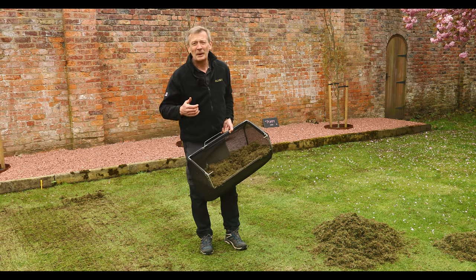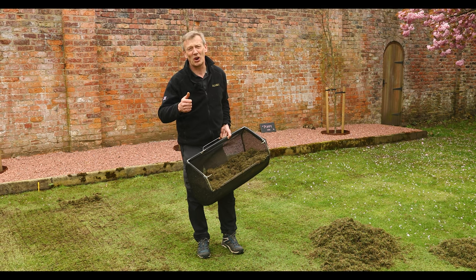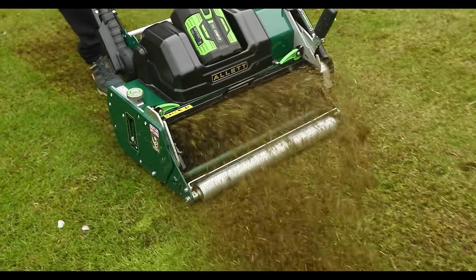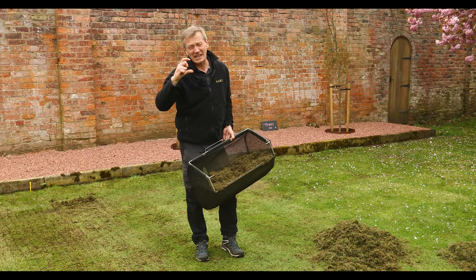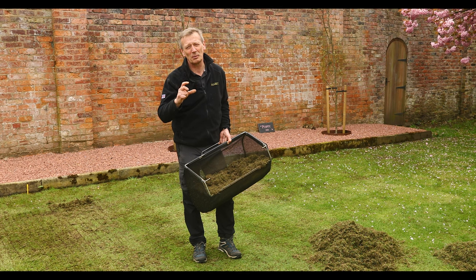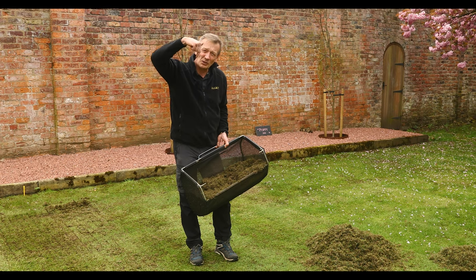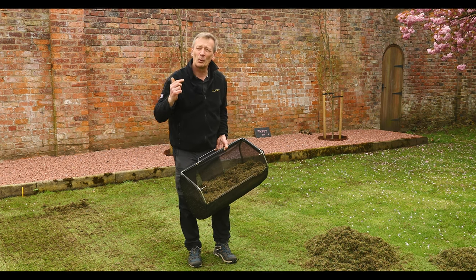Secondly, if you set it too deep, it really does pull the machine along — you don't even need the rear roller drive. But the other issue with setting it too deep is that the bristle needs to be targeted at where the debris is. If you allow the bristle to bend too far back while brushing, you'll start to get breakage of the bristle itself. Please pay special attention to ensure this cartridge lasts as long as possible — don't set it unnecessarily deep. With brushes, deeper isn't always better; brushing with just the tip of the bristle is far more effective than trying to pick up material with the back of the bristle.